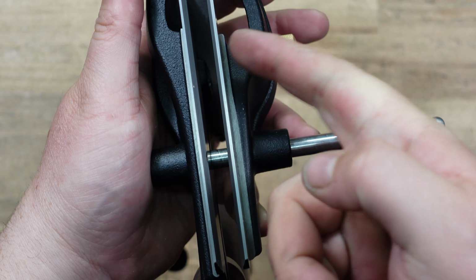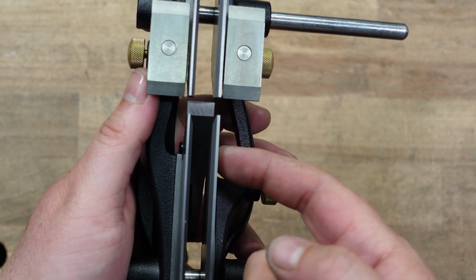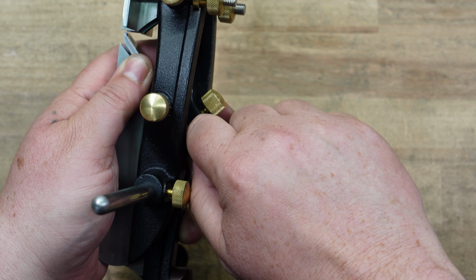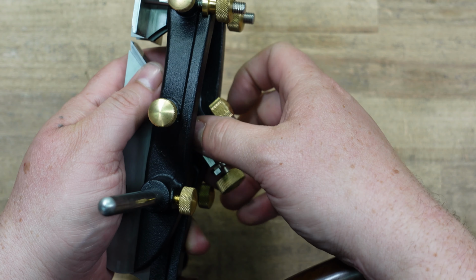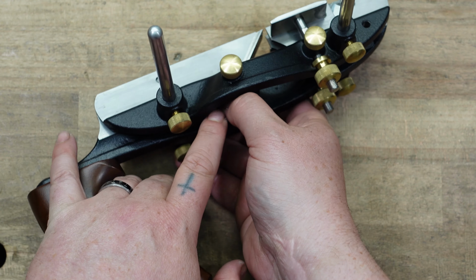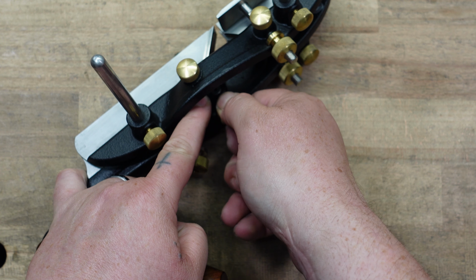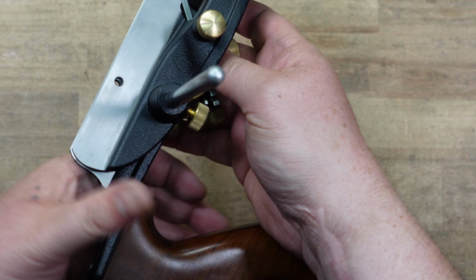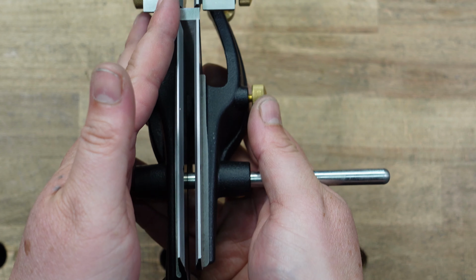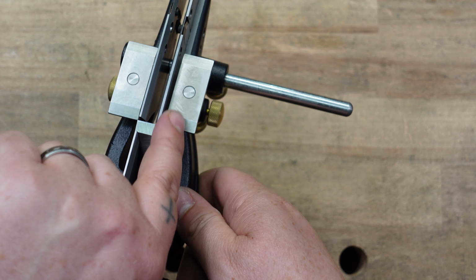See how it's hitting the iron? Way off camera. See how it's hitting the iron like that? So what I need to do now is loosen the iron and adjust it to where that skate slides underneath. Then what I do is I push the iron down. So hold the iron down however you're going to, and then tighten your cap, okay? The reason I say hold the iron down is because if you push down on it, it'll line itself up on this side, and all you have to do is worry about this side,